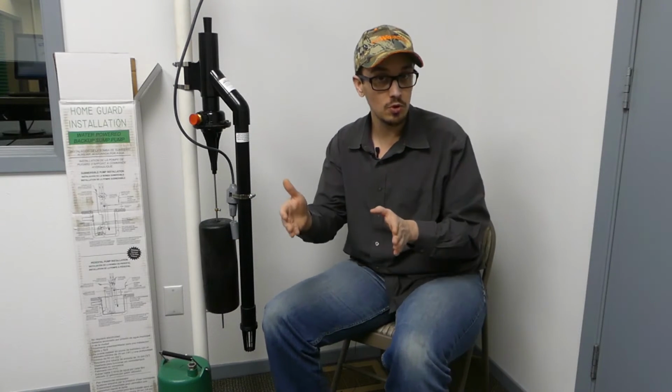All right, so as far as pressure, jumping back real quickly, the recommended operating pressure range for these systems is 20 to 80 psi. So if you're somewhere in there, you're in the sweet spot, this might be a good option for you. Again, pressure does correlate with maximum head or lift capabilities, so make sure you double check on the performance at your pressure to verify if it's going to be a good fit for you.